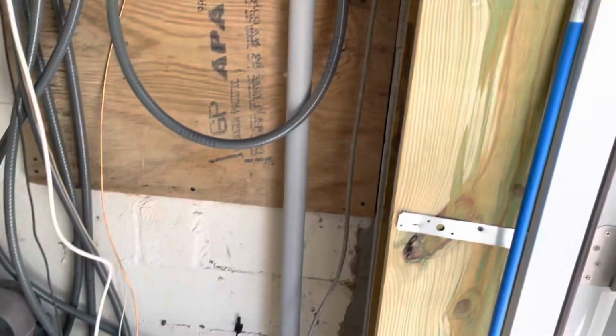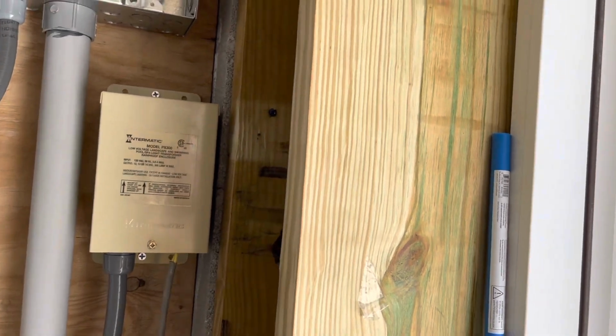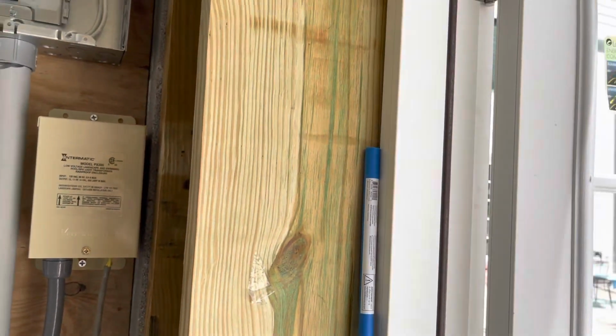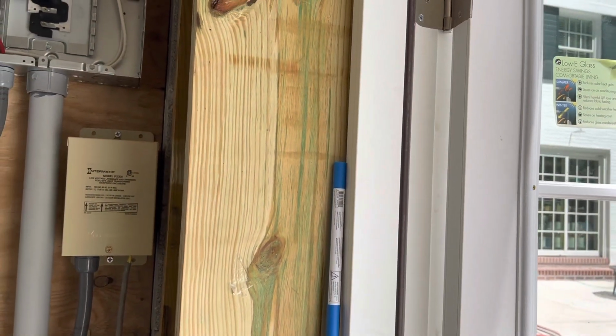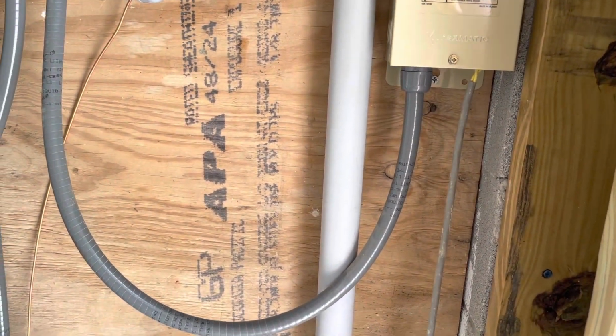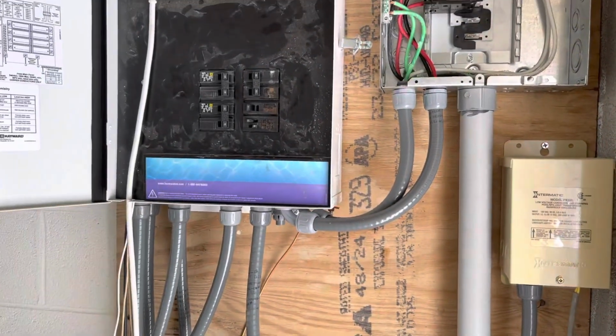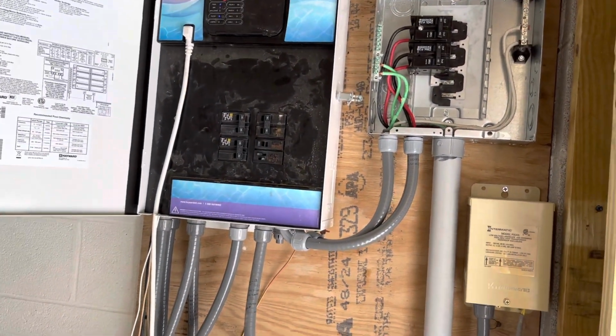When I do that, I'm gonna put a strain fitting on this wire over here to keep it from getting pulled out of the bottom of the box accidentally. Probably do a weather tight strain fitting. That way it's sealed from the elements. This space here is left empty for our water fill control panel. That'll get screwed right there and hooked to the main breaker panel here.